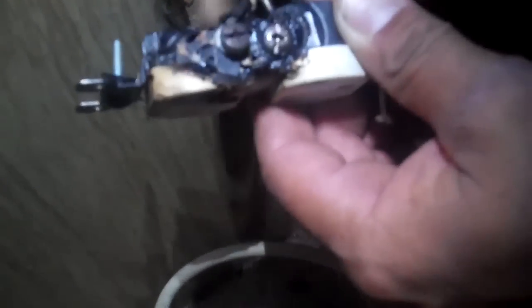It doesn't even look like it goes all the way around — and then it broke. Look at what somebody did: they took the insides of a wire nut out and put it onto the ground wires for some reason. That's crazy. On this other side, the connections are probably not loose because it's melted — but yes, this side is a loose connection.